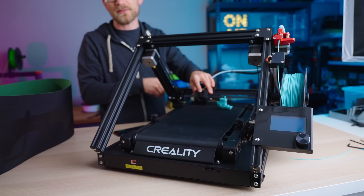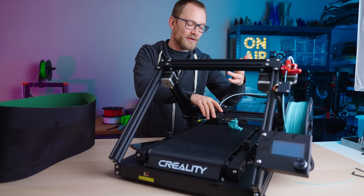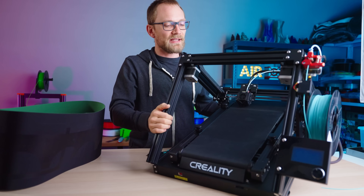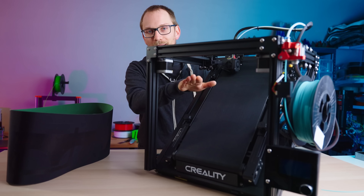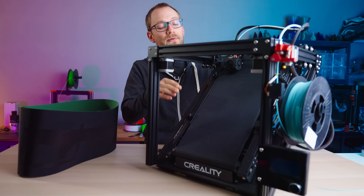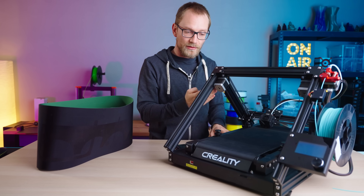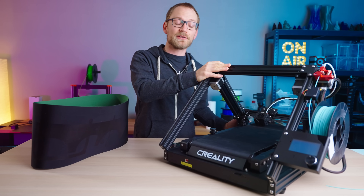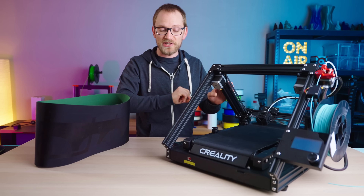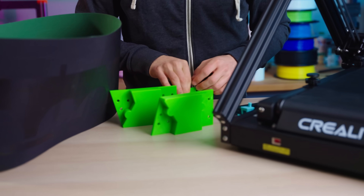What I already did is bent the toolhead into the belt so it pushes more into the belt material — not perfect for geometry, but it helps a bit. So what we're going to try today is to fix both of those issues by technically tilting the bed up so that the angle between the toolhead and the belt surface is not as steep anymore. I'm going to transfer this from 45 degrees to 15 degrees. We could angle the belt up, but we can also take the XY gantry and angle it down — so we're gonna build a CR-30 lowrider today. I've modelled up a few adapter pieces and we're gonna install it. Let's go!